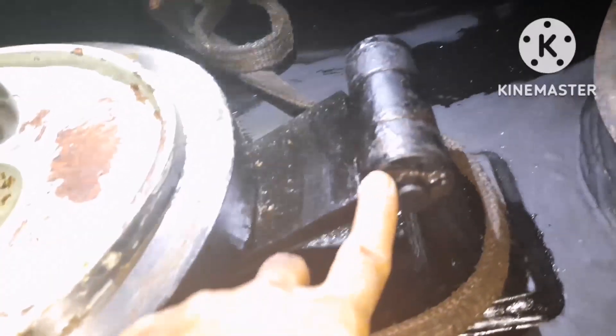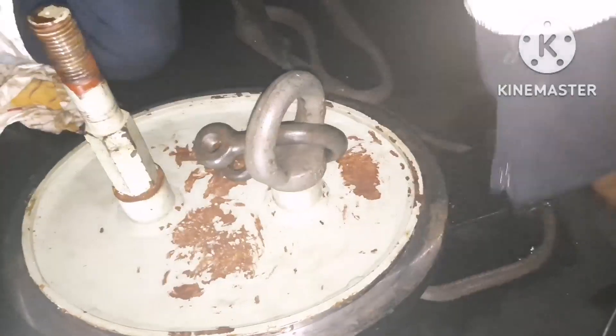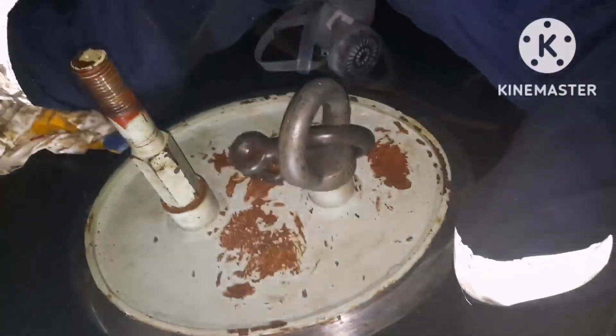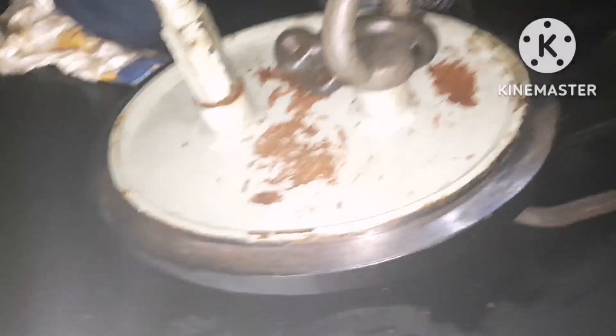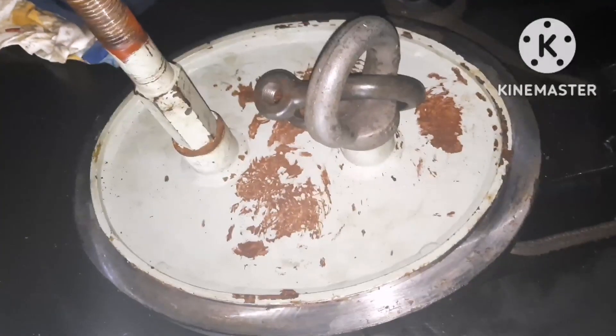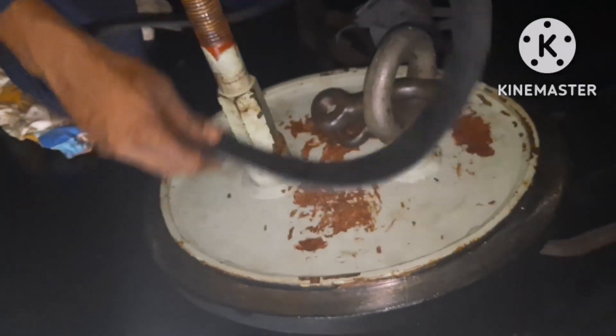Just check the pin — these are the hinges, just check the hinges. This is the eye bolt where I fit the eye bolt for lifting back. For lowering it should not be an issue, but when fixing back you need a strong belt to pull this heavy door towards you. Inspect the manhole cover properly and change the gasket. This is the new gasket we are fitting — it should always be a rubber gasket.